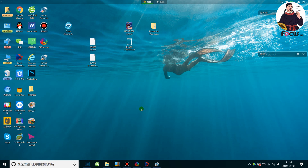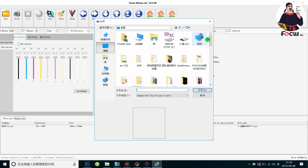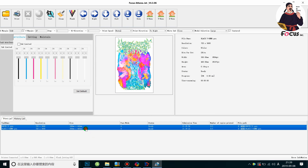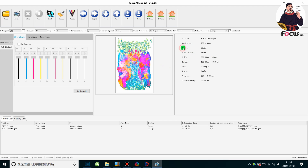The print pallet must be vertical and horizontal, no scratch print head. Adjust the up-down position to be sure the gap distance between the print head and the t-shirt surface is safe. Then we open the control software, go to the file, and select the file that we ripped before — the black t-shirt demo. This picture was processed before. And then we do some settings as with the white t-shirt setting. From here, the color shows 5 colors.